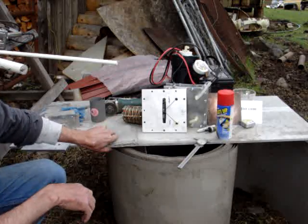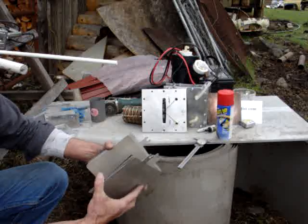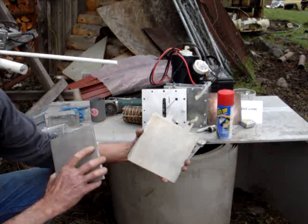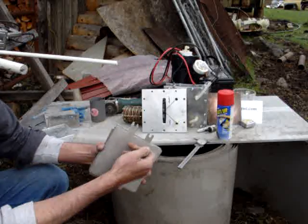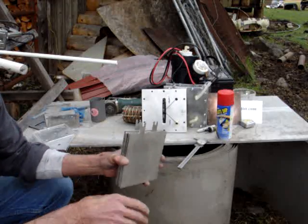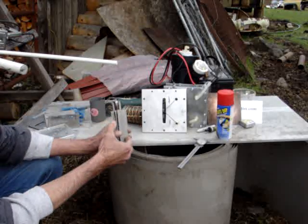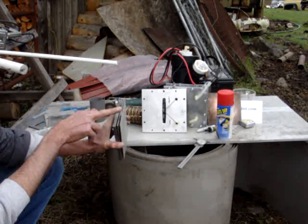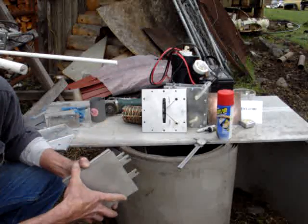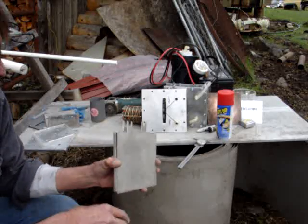I call this a Kcell because of the way I drill my plates. On your anode, the center plate, I don't drill any holes. This way, it feeds from both sides, gas out, water in, so it's 2 cells in one, literally. I have 4 neutral plates in between the anode and the cathode. Anything less than 4 and it turns the water dirty quickly. It draws too many amps. 4 seems to be the right combination.